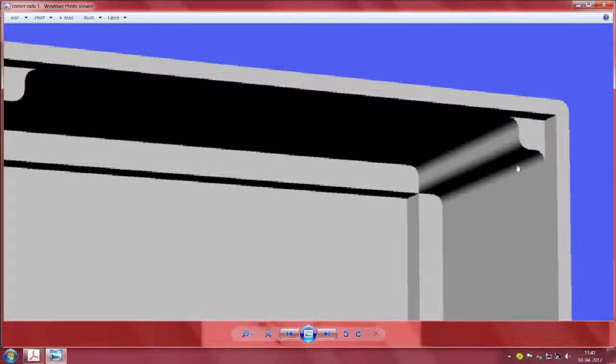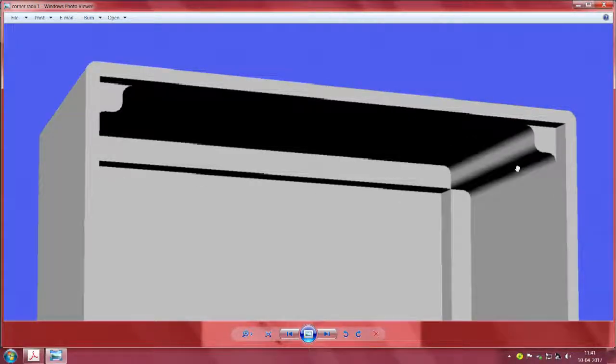And this is exactly what is followed in the case of regular injection molded plastic. This is only shown as a matter of saying it is possible to do, but in reality it is not possible to make things like this. In extreme cases where you want to simulate that, this has to be passed to a person who is doing the molding, you can probably do it by taking a piece like this, putting it through a milling machine, or through a routing bit, and then try to make a profile and make it sit here, and after all the operations are over, remilling it to make sure it looks a little like the original.